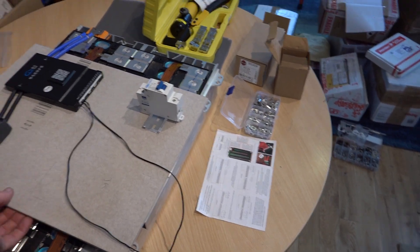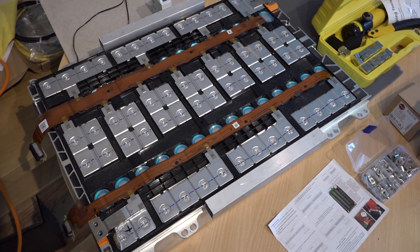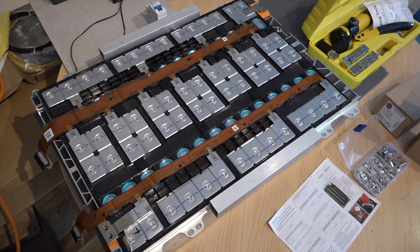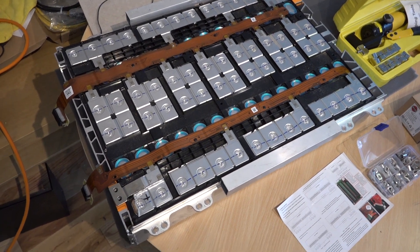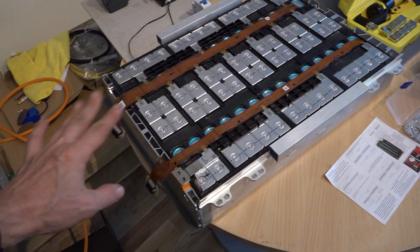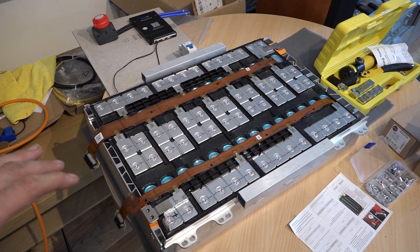Just take this off here for a moment and you can have a look. Make sure you don't short anything out. It's a 16S - 16 banks of cells all connected in series. Each cell is a 95 amp 3.6 volt cell, so we've got 180-190 amp hours at nominal 48 volt DC. This came from a pack of cells - the whole thing was a big tray. There were eight of these in a pack in a floor pan of some kind of Mercedes SUV.